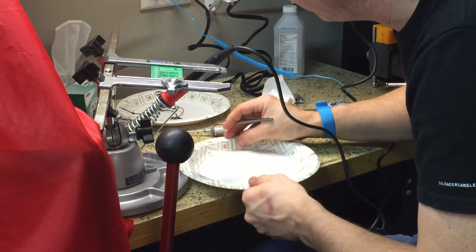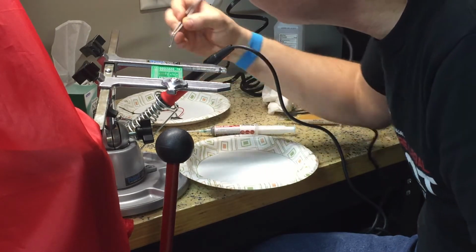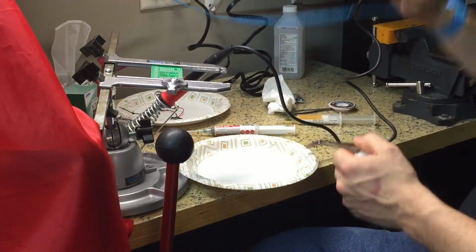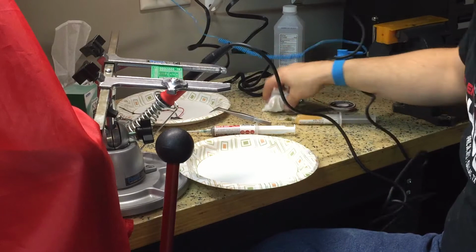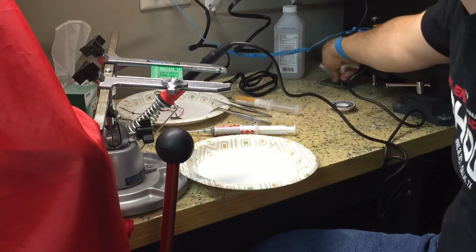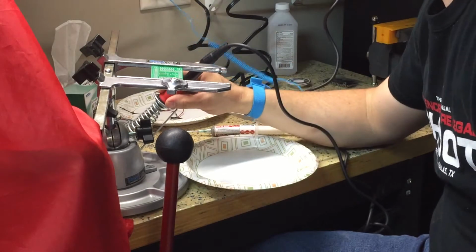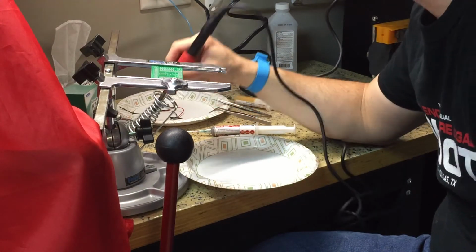This resistor is flipped over. Boom. So I just took the plate, kind of hit it on the table. Seems to have rectified the situation. Alright, turn the soldering iron back on. Tweezers in the tool spot. I can move the tips out of the way and the braid out of the way. 600 degrees. And now we're at 650.